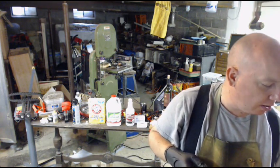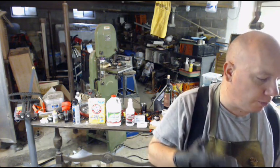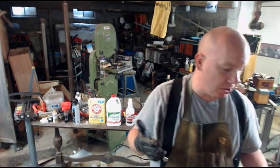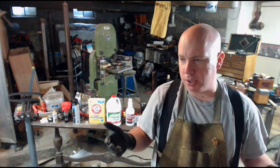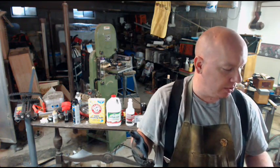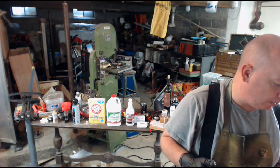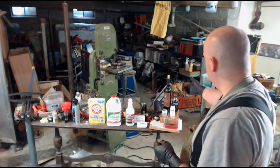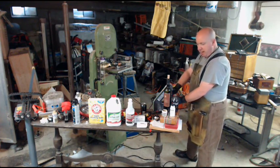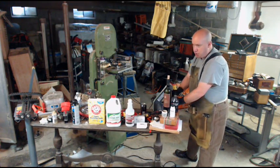If you're doing a piece of delicate jewelry or more or less finished jewelry, and you don't want to screw up the surface finish of the piece, something like this hinge, you don't want to scuff it all up just to have to polish it again later. You can go at the area that's going to be soldered with some fine sandpaper. Whatever it is, you want to have a fresh, bare metal surface. So clean and bright. The clean part is, wash it. Soap, water, rubbing alcohol, whatever. Get any grease residues off of it. And then you want it bright. You want to hit it with some sandpaper, or a benchtop sander. This one's not even plugged in, but it's handy because we got the belt here, and it doesn't take much.